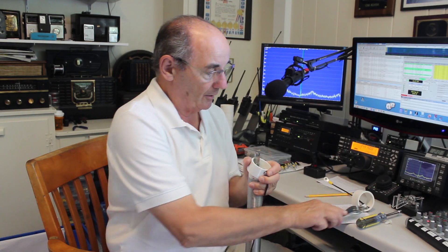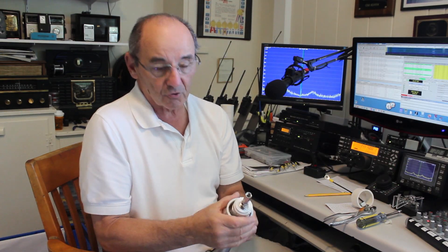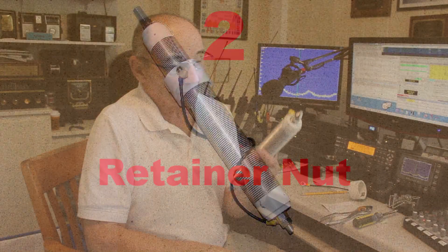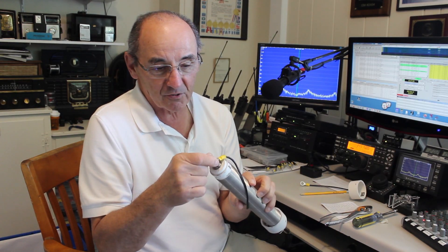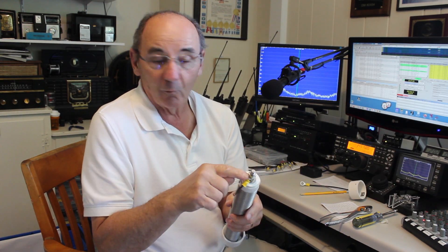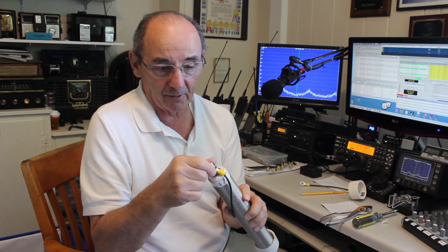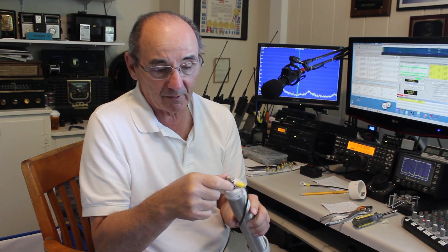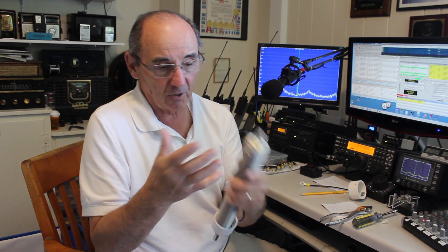If it's too tight — and that can happen also — just squeeze it a little bit, and this goes back on. How tight is tight? Tight enough that you can move it, but it wouldn't move if you pushed it hard. Now, I also get questions about the nut on the bottom. They want to take this nut off and tell me they can't get it off. We put Loctite on there, so it may be very difficult to get off. But if you put two wrenches on there and really turn it, you'll be able to get it off. Some people have even had to heat it up a little bit, but that nut will come off and you can't break anything — it's all stainless steel.